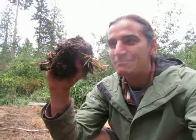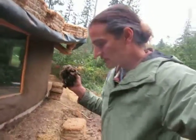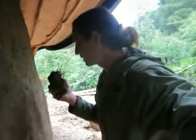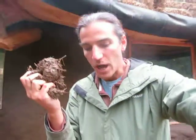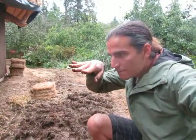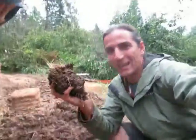This is a clay soil. We're talking this concoction of mud that I'm holding in my hands can build entire wall units. It's called cob because it's an old Welsh word meaning lump of mud, so in northern Europe they've used this style of building for centuries. Breaking down this lump of mud, it is a conglomerate of 70% sand to 30% clay soil — not ceramic clay, but a clay subsoil. In most parts around this entire country, around this entire world, underneath that topsoil layer you're going to find a clay subsoil, and sometimes in that clay subsoil you have that perfect proportion of sand to clay ratio.